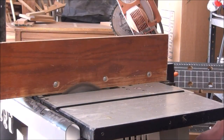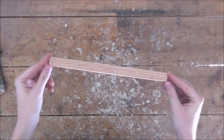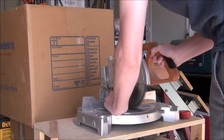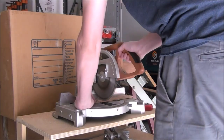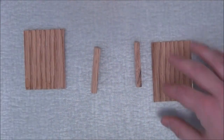So let's go make an official looking Monopoly piece carrying case. I'm gonna make a pretty simple box, so I just went ahead and cut off one strip of oak wood that is 1/4 inch by 3/4 inch wide. I then repeated the process, only this piece was 2 inches wide. After that, I then cut 3 2-inch long pieces out of the skinny piece of oak, and 2 2.5-inch long pieces out of the chunky piece of oak. And we are left with this.